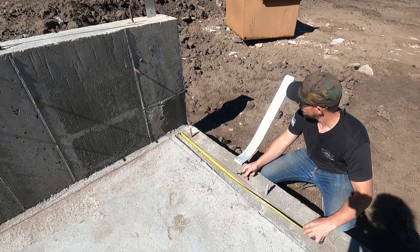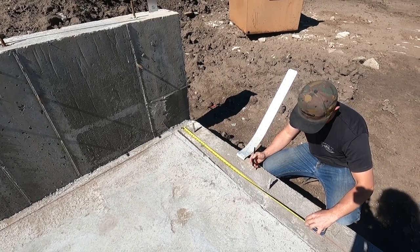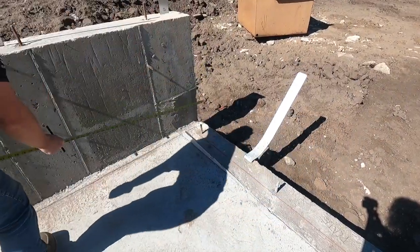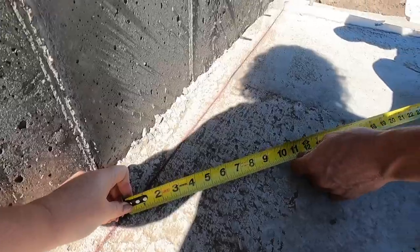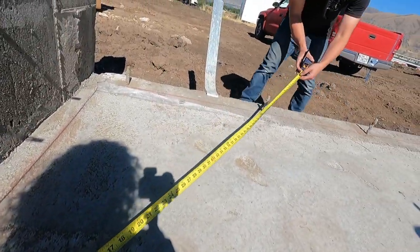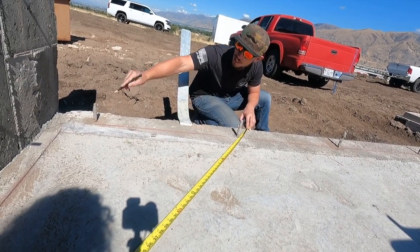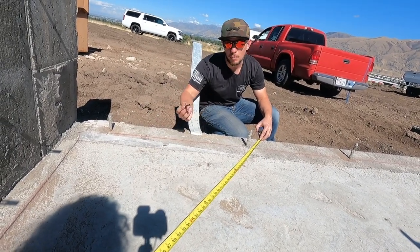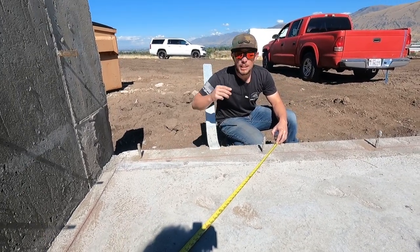For the 3-4-5 rule, you come off your line and make sure your tape's on where you're squaring it to. We're going to come off three feet, then come off the other side four feet. Have your assistant hold it on that corner, then come to your other mark that's on the line, and where you're hitting the line is five feet — this angle is square. So these are your base lines. They did it in a bigger scale, and now they can run all their chalk lines off this so they stay square to the house.